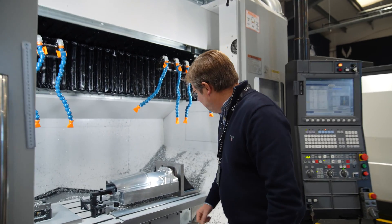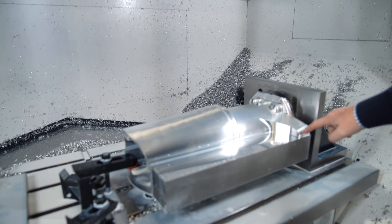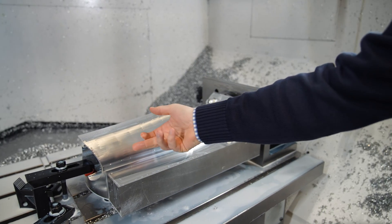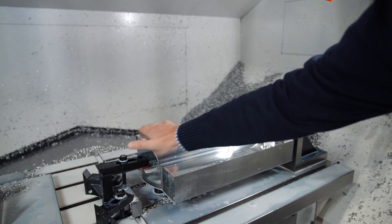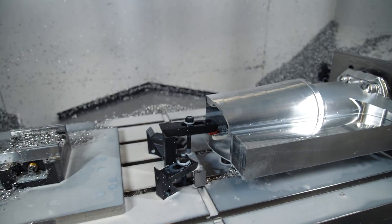Have a look at this — that's my hand there. So this is the top of your pitch horn here. This is the cuff that basically the strap packs go down the centre of. Your lag damper lives inside there. And then we've got a smooth aerodynamic fairing onto the composite part of the blade down here.